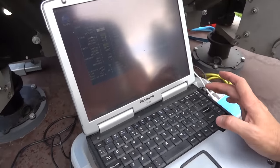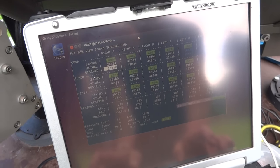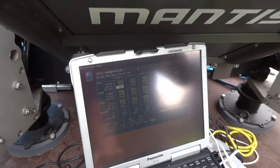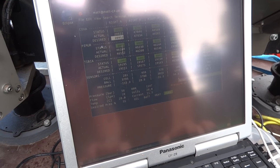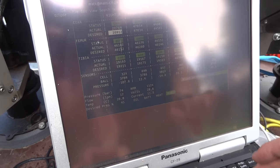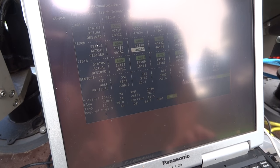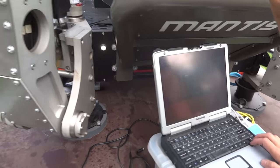What I can do from this interface is dial in some pressure. At the moment I'm going to start bringing up the pressure — I'm at 25% pressure now. I just need to see what that is in real terms. I'm at 43 bar at the moment, so I'm going to keep going up. I'm actually controlling the hydraulic pump right now and I'm bringing it up to 74 bar. Now what I'm going to do is enable the right middle femur to try and open — bring it back towards me so I can spin the leg out.